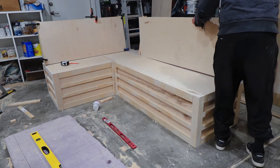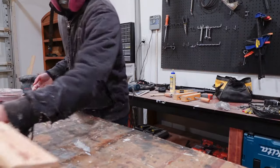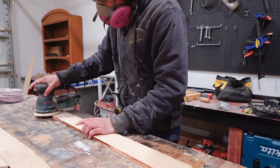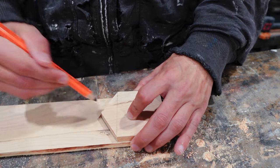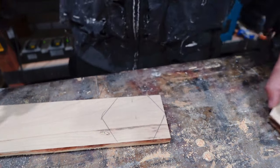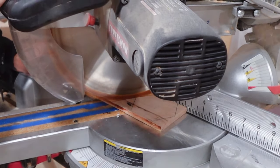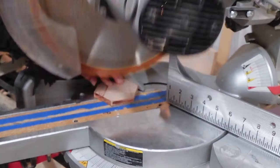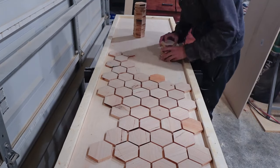I cut out the plywood backing sheets for the backrest from three-quarter-inch plywood. For a design feature, I picked up some cherry boards cut at half-inch thickness, ripped them down to about three inches wide, and mocked up a hexagram shape as a template. I traced it out and cut a bunch of pieces on my miter saw, keeping it static at a 30-degree angled cut and rotating to form the hexagram. I cut somewhere between 50 and 100 of these pieces.